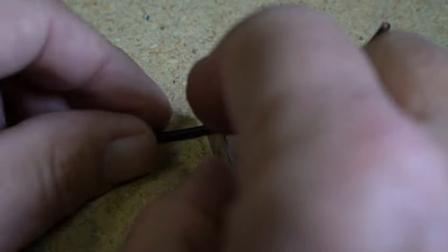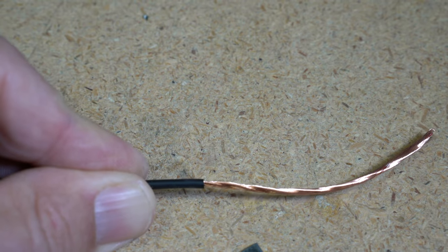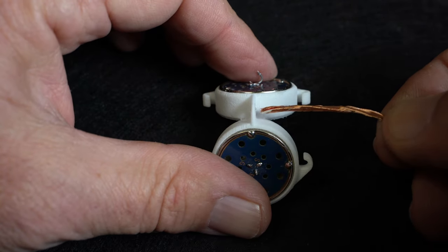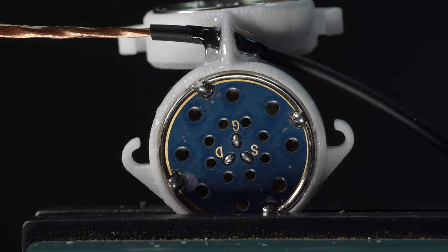Strip about 2.5 inches of the outer insulation of some Mogami W2697 wire. This is much easier now than after it's attached to the capsule mount and glued in place. Thread the wire through the hole, leaving about 3 inches sticking out. Apply some of the E6000 adhesive to each side of the wire to hold it in place.